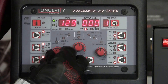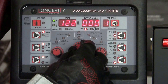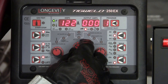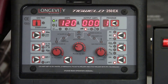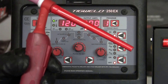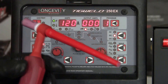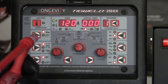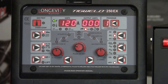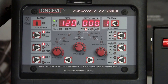In the middle here is your amperage for your heat setting, and depending on what you're doing you're going to adjust that differently. For 10 gauge metal I'm going to set it at 120 amps. The water-cooled TIG torch looks pretty much just like this — it's got a nice insulated sleeve that protects it all the way up to the torch. Here is your hand control, which we're not using today — we're going with the foot control. So now you're ready to weld, everything's set up, tungsten's got a nice point on it, just get your material, push down on your foot control, and you're ready to weld.